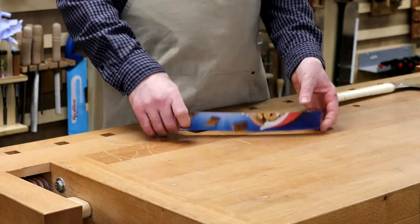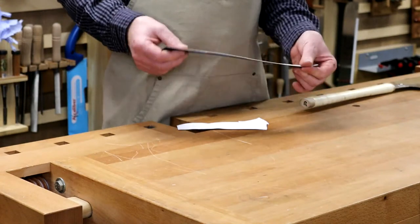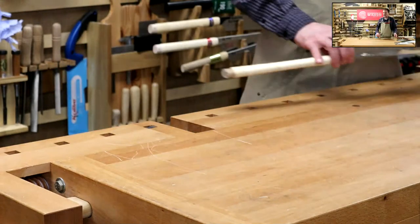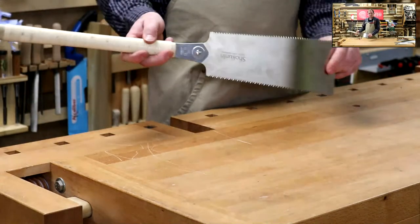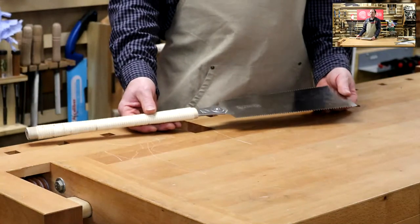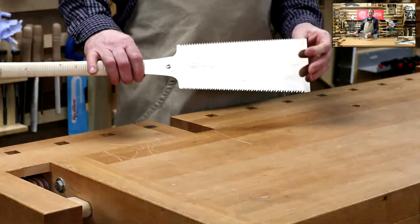Fantastic. Western saw, if you push it too hard and you buckle it, you bend the saw. But it has to be thicker to give it that structural strength. So a Japanese hand saw can be thinner in section. Okay. So this will flex more. Right. It can be harder material, so it'll stay sharper longer. It will hold that edge longer overall. So all those things are a benefit.